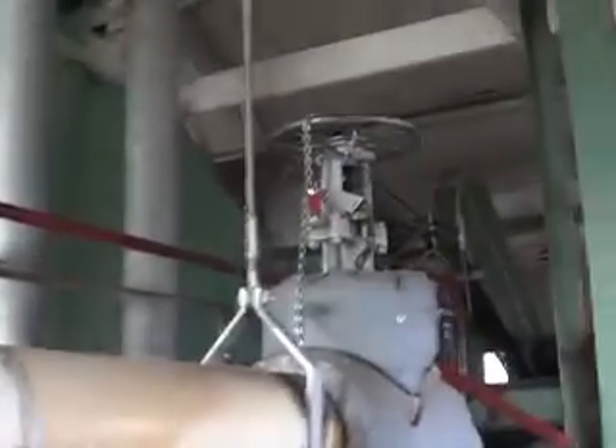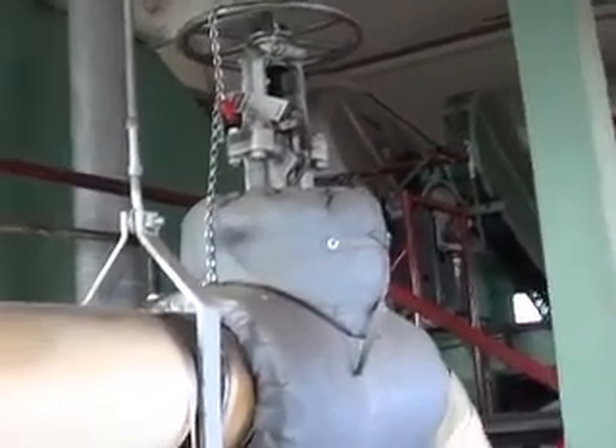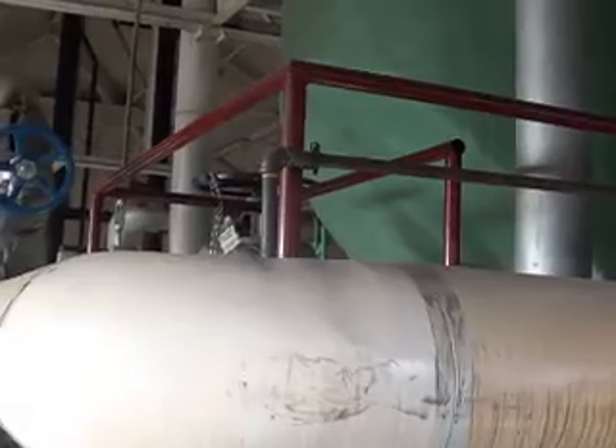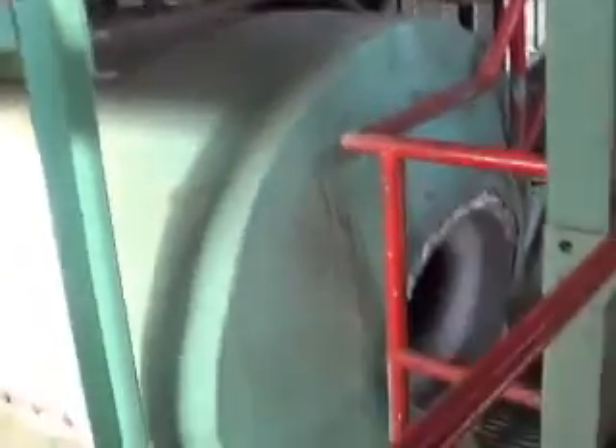There are the shut-off valves, and there are the water-cooled bearings I showed you a while back. Here's the non-return main steam. Here's the steam drum — little steps and stairs, it's hot once operating. Got your safety valves here. We run at 160 psi operating pressure and we send out 45 degrees — 45 pounds — to the loop.